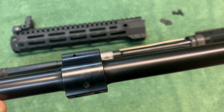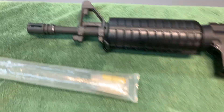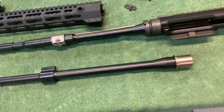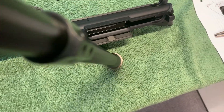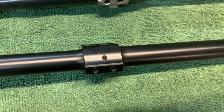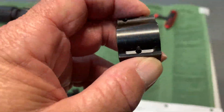It comes pre-drilled so you can lock it in place with the set screws and then put the pin in. I'm not going to run any gas block or front sight block that's not pinned on my guns — people can do it however they want, but if it's not drilled and pinned, I don't want it. Also notice how thick and beefy the bottom of this gas block is, so the screws are getting a good bite to hold it in place for drilling.